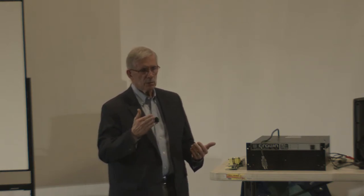So if you're going to meet the spec, it's with it all the way up. Now, what was the question again, Aaron? Just kind of the relationship between the input and output. Okay. So if you take a hi-fi amplifier, which 1 volt will drive to full power, and you feed it with an 11-volt output signal from a console, what are you going to do? It's going to be into instant distortion. So the purpose of the level control is to compensate for this higher voltage that's coming into it. You see what I'm saying?